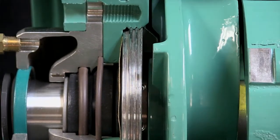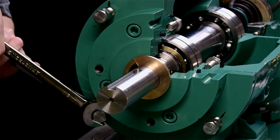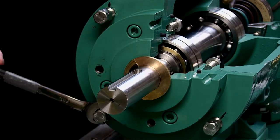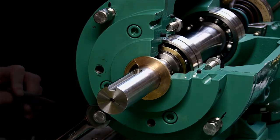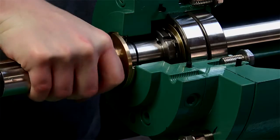Once interference is felt, move the impeller away from the upper cutter. Loosen the clamp bolts, rotate the adjustment sleeves one flat counterclockwise, and retighten the clamp bolts until the shaft turns freely with no contact.